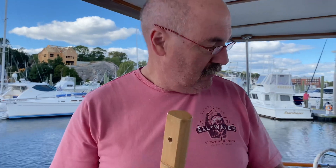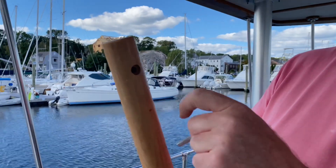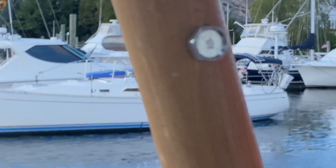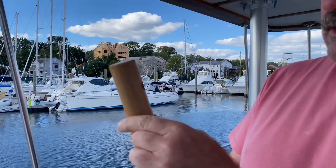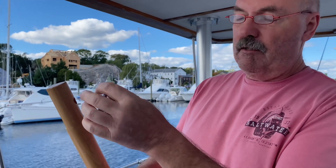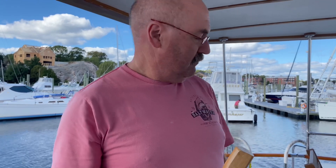This is not going to work in a marine environment. We're going to get stainless. And look right there — it's a countersunk head that doesn't fit. So I'm going to get stainless with round bolts, and if the pan heads don't fit in that either, then I am going to countersink it a little bit more.